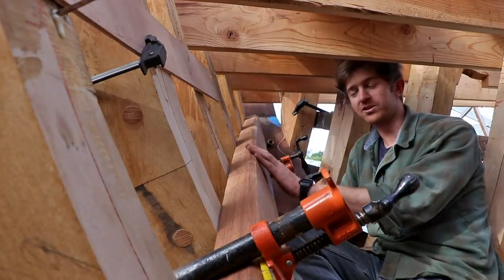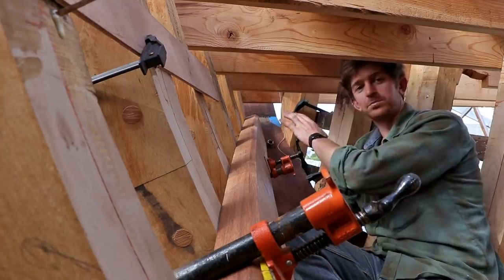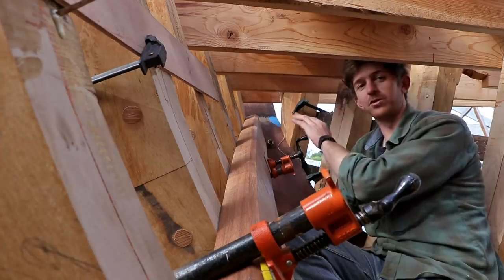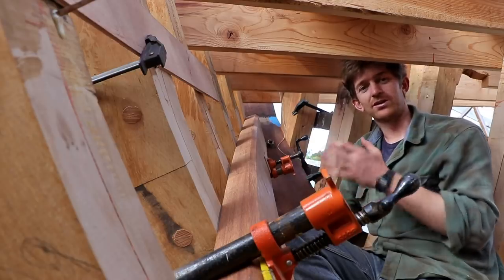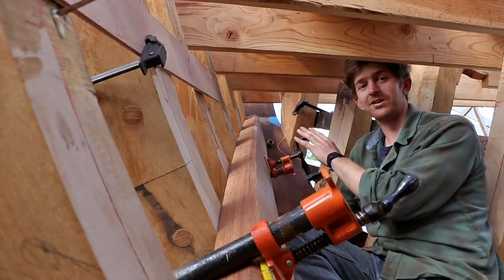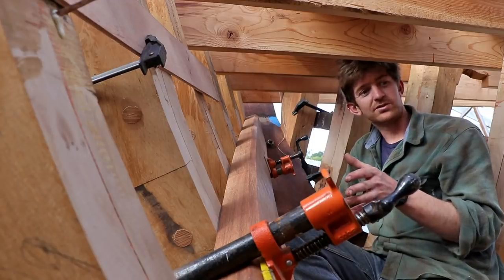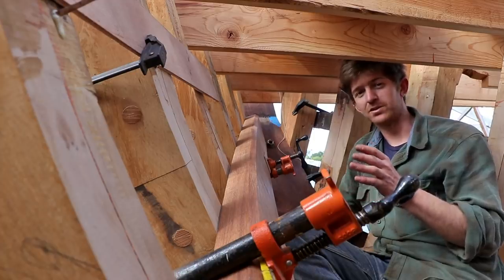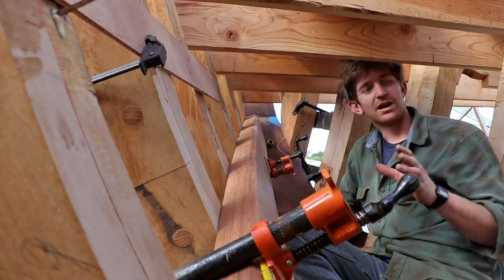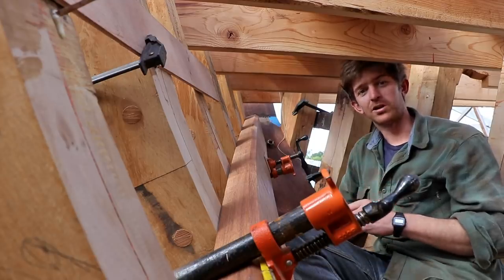So we've got the port side stringer roughly in the place where we want it. I'm just taking the bevels from the front of the stringer where it's going to meet the stem, so we can take it out again and cut that joint so it'll fit up nicely in there, nice and tight. So far getting in has been not too difficult. It's an easier curve than the beam shelf, I think, but we haven't got the twist into it yet and the edge set, so there's still quite a bit of work to do, and that last bit might be quite hard.